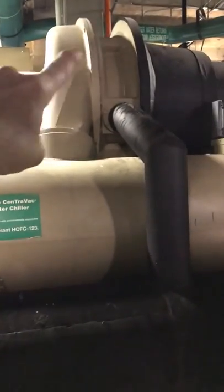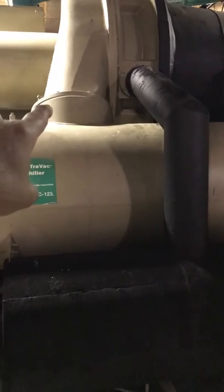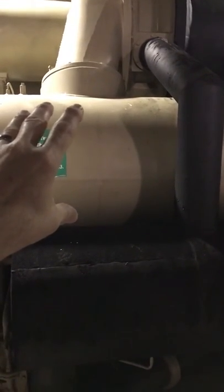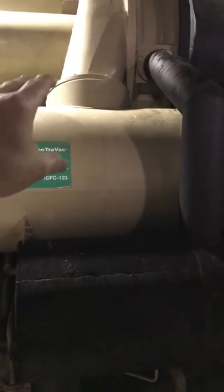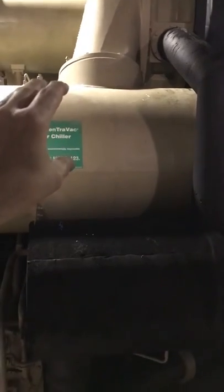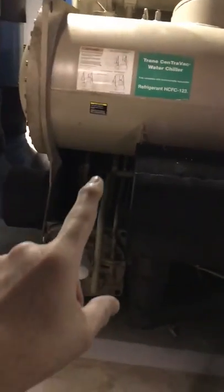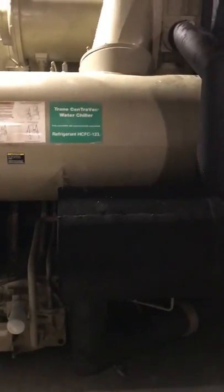At the same time, here's the discharge off our centrifugal compressors — this is our hot gas. It goes into our barrel, and as the water flows, the refrigerant on the outside of the tubes is cooled and the heat is removed. As we remove that heat, that refrigerant turns from a hot gas back into a liquid at the bottom of the tank, and then the process starts over again.